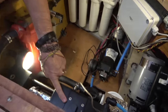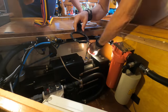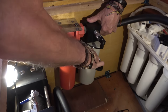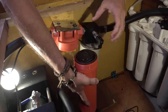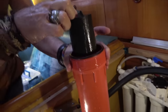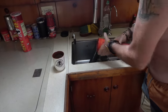To start, we open up this depressurization valve right here — that releases any pressure still inside the filter housing. We'll likely get a few drops of water out. Then we loosen the housing — got to be careful, it's going to be full of water. And yeah, as you can see, that filter is full of sediment from the water. We've been through some anchorages with a lot of sediment, and this is the consequence.